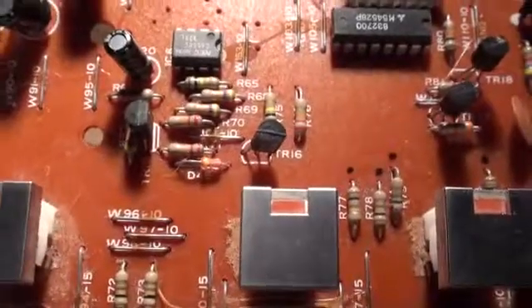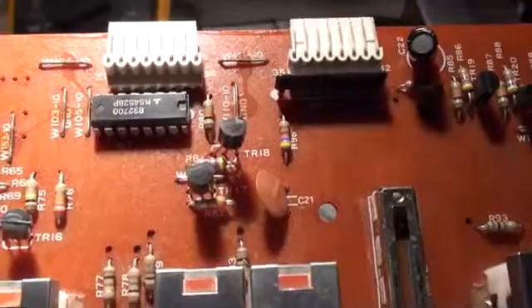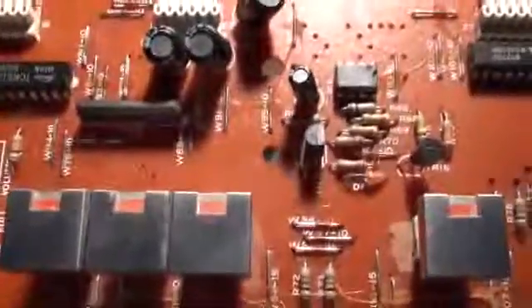The situation here is that it basically stops the LEDs from flickering so much. I don't know what the actual mechanics are, but I do know these are 100k resistors coming out and 220k resistors going in. One of them is going to be removed and replaced with zero resistance. Murray knows what he's doing at Kiwi Technics, so just follow the instructions. I'm going to be desoldering all of these and replacing them with the ones from the kit.